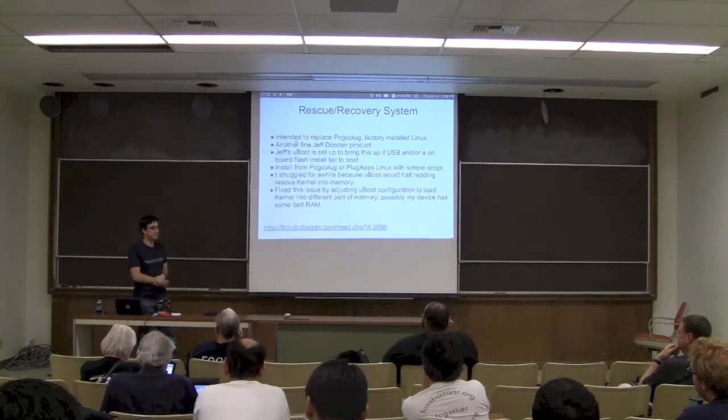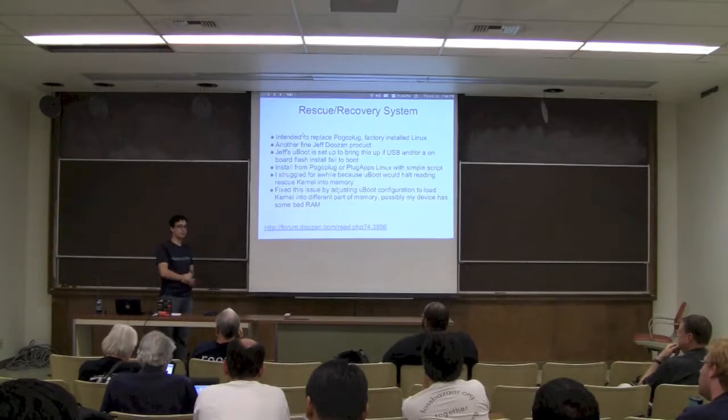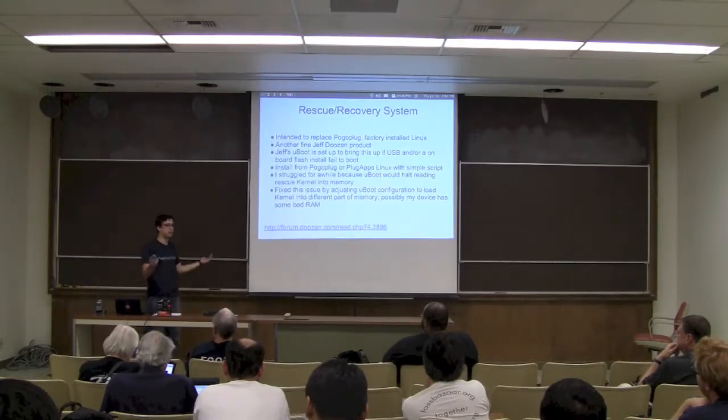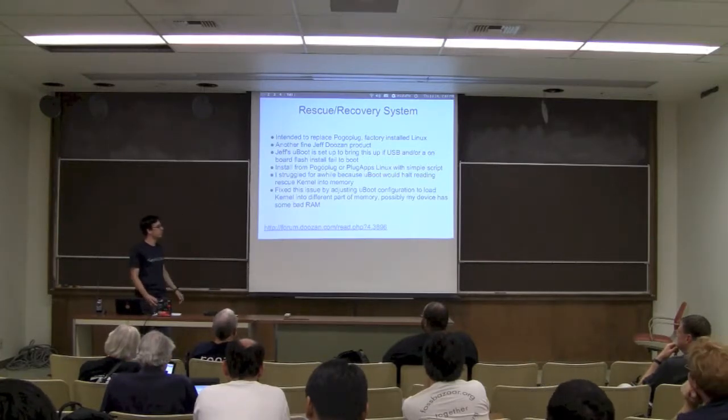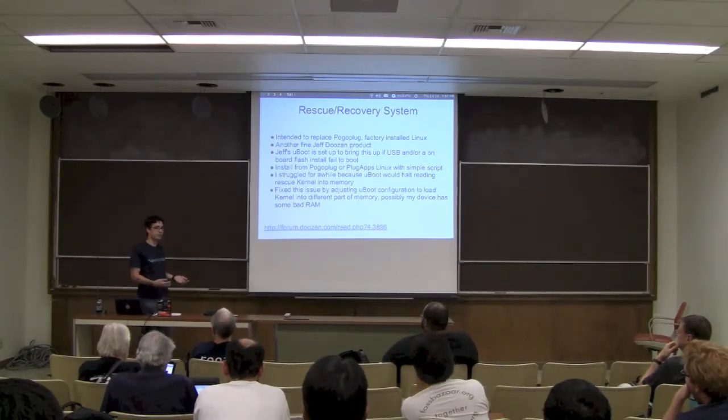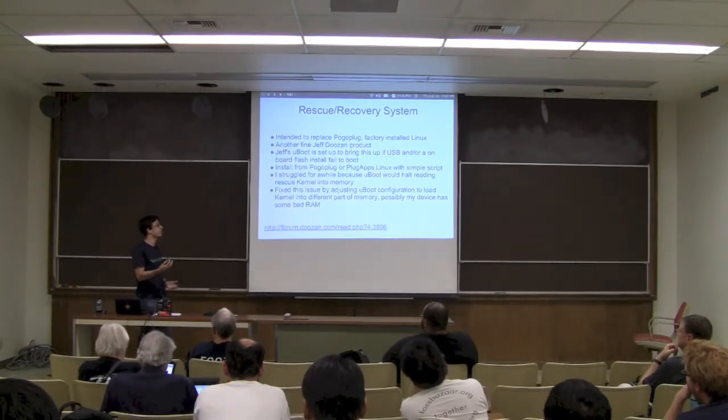I think this is not typical because I haven't seen anybody actually saying, this is what my bootloader showed as it was loading and it stopped here. So the bootloader would actually just put a little star saying I'm loading in the memory, and it would stop. Other people would stop at different points for different reasons. Other people would actually get to the point where the kernel started booting, but maybe they had the ARC number wrong. So I just changed the offset, which looks like a magic number, but when you realize what they're doing, they're basically just saying, here's where to load the kernel command.